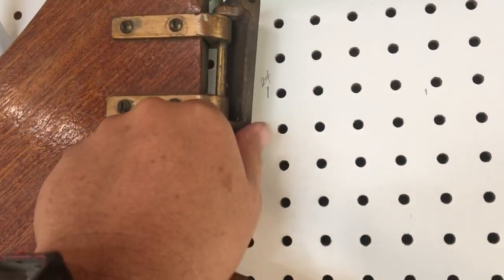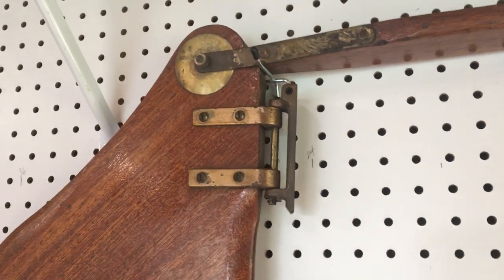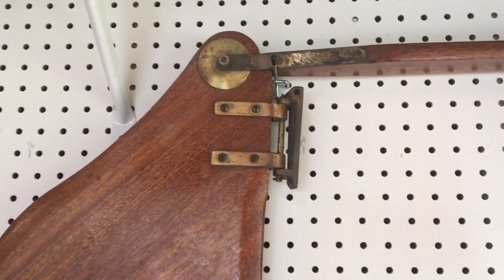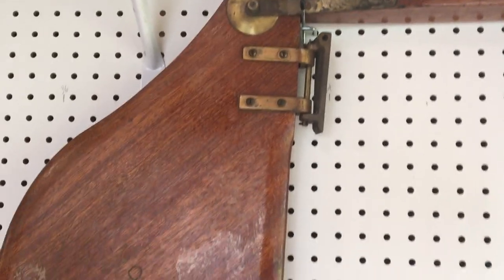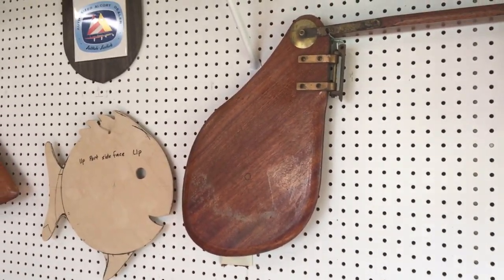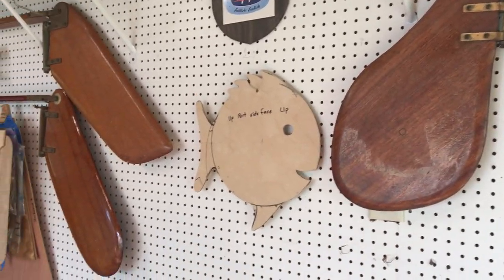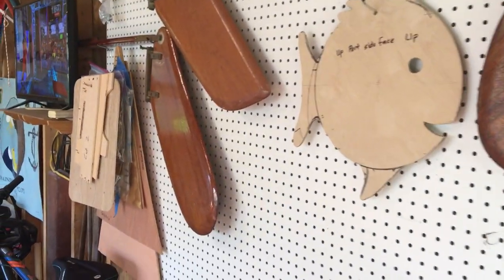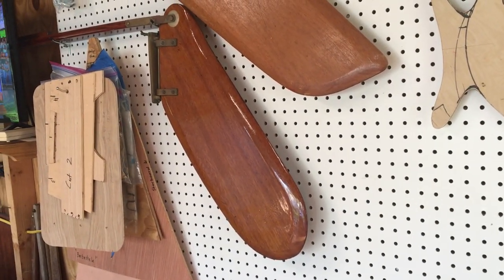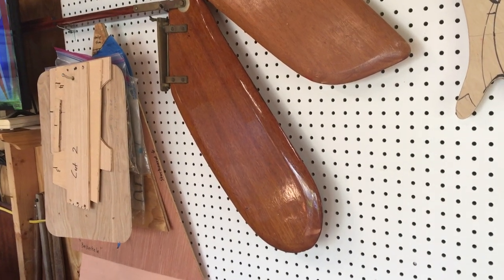A little vertical plate clipped into the shorter transom on the wooden boats, and then later on the fiberglass Sailfish, which is the Super Sailfish Mark II. The early rudder design was what we are calling the elephant ear. I think as they came into the fiberglass boats with the deeper keels, they found out they needed a bigger blade. And I'm calling this one the spoon tip.